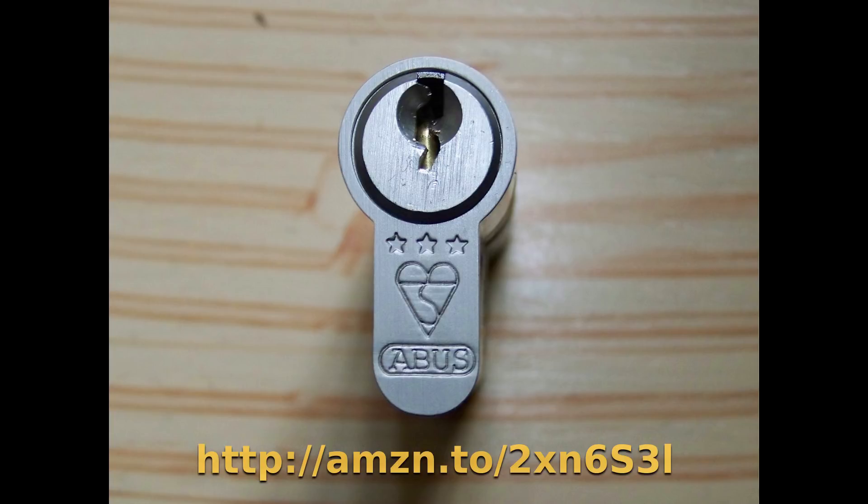When looking to purchase a replacement cylinder for your door, it's best to find one with the British Standard three star markings on it. These are ones that have been tested and are resistant to the lock snapping technique used by some burglars. There are other ones that are only one or two star, and with these you also need to replace your handles with ones rated one or two star to achieve the three star rating overall. Whereas if you find a lock already with the three star rating, you don't need to replace any handles. They're not that expensive — on Amazon, link in the description below, you can pick them up from around £20 to £50 depending on what brand you go with.